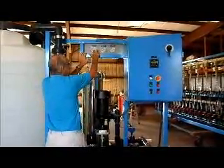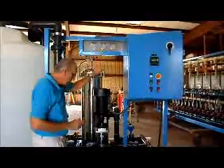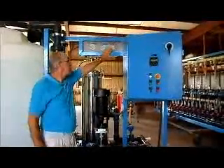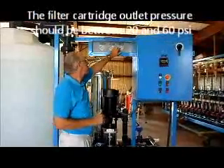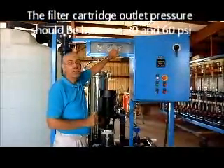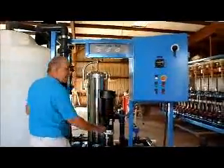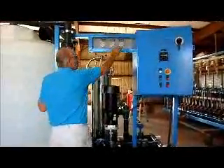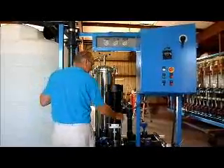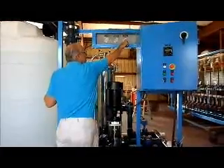If there's a large pressure drop between your pump discharge pressure and your cartridge filter pressure, you can adjust these valves. The important thing is that the pressure going into the RO membrane should be between 20 and 60 PSI, preferably between 40 and 60 PSI. If the cartridge filter is fouled and the pressure drops too low, the cleaning will not be as effective. You have to adjust these valves and use clean cartridges to keep this pressure between 40 and 60 PSI.